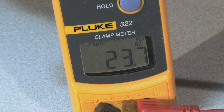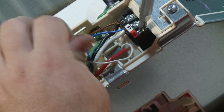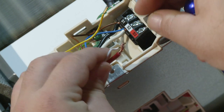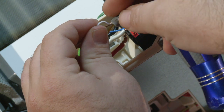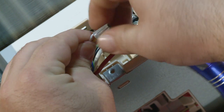In this case, start by looking around for what could be breaking your communicating voltage. Condensate pumps are the number one cause for this, along with junction boxes with loose wire nuts or just having a cut wire. If the condensate pump is wired to break the S3 wire for safety, it could be your condensate pump not pumping which is causing your communication error.